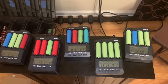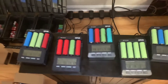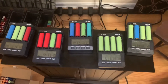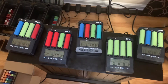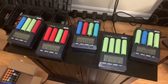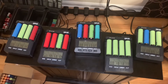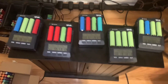Here are the issues I've run into. They do have a feature where they can tell you the capacity. I just do the charge test: it tops up the battery, discharges it fully, then tops it up again and tells you the amp-hours during the discharge. It also has a separate test for internal resistance. My nitpicky thing is I wish they combined those two tests together. I skip the internal resistance test altogether because the number one priority is capacity.